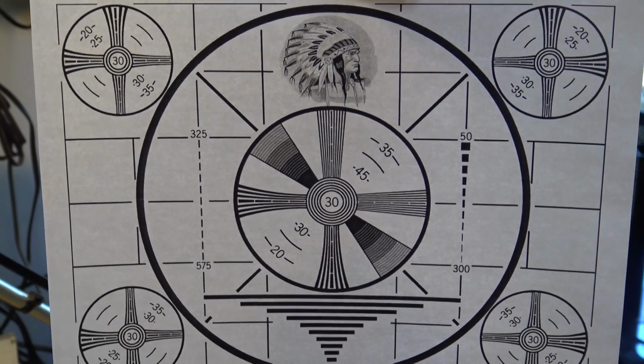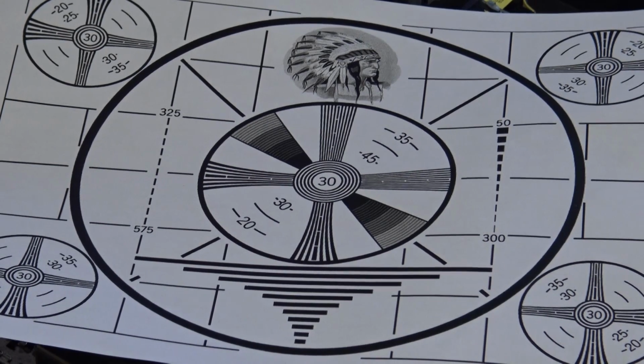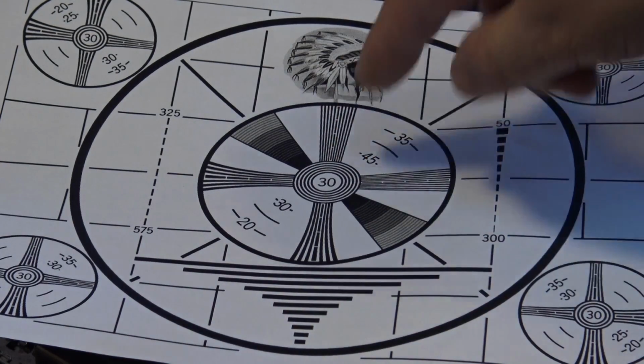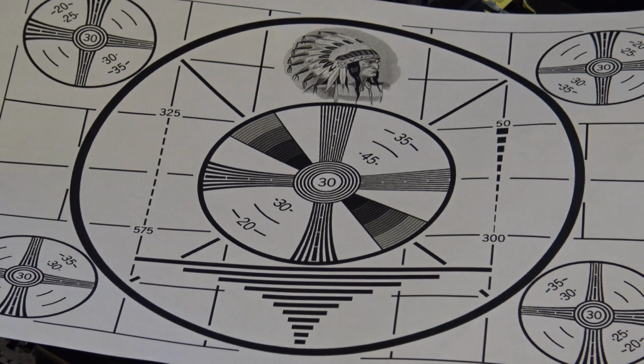And typically this was generated by a special type of camera called a monoscope test pattern generator. This test pattern was basically produced two different ways depending on the type of setup that was being used. A monoscope camera was basically a CRT that had a metal grid with this test pattern engraved internally. It wasn't actually a real pickup tube, it was a metal target that was built into the tube. This was etched onto the tube itself.